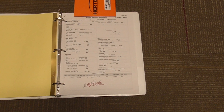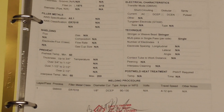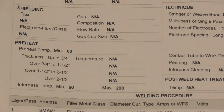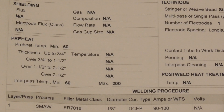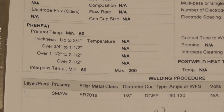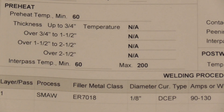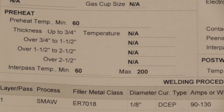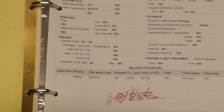Here's a welding procedure specification that I wrote. There's a lot of information on them, but down here at the bottom under preheat — on the very bottom there — interpass temperature: minimum of 60 degrees, maximum 200 degrees. Hopefully that gives you a good idea of why we take interpass temperatures on multi-pass welds, what the interpass temperature is designed to do and prevent. That's all I've got for today — thanks for watching and subscribing to TVWeld. We'll see you next time.